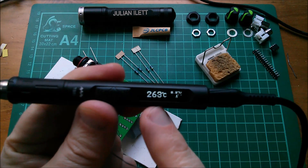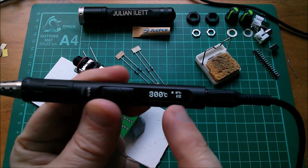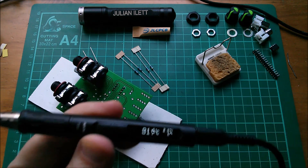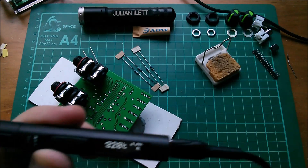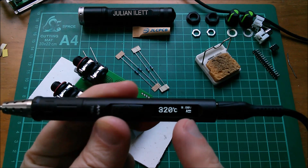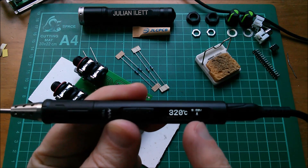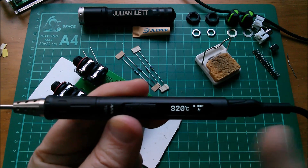The iron timed out — someone rang me — so it's getting back up to temperature. It actually says 8.37 volts, so it's quite low — not nine volts coming out of this thing. Oh, it's gone up now. That was while it was heating. Now it's up to temperature it's alternately 9.0 volts and 8.3 volts, so it's turning on and off.